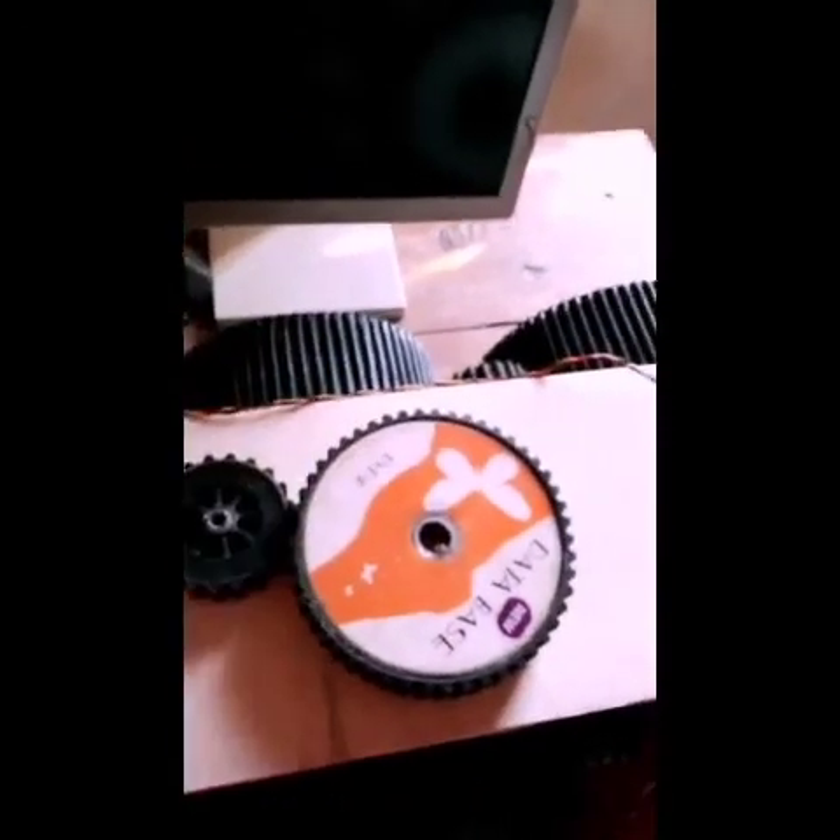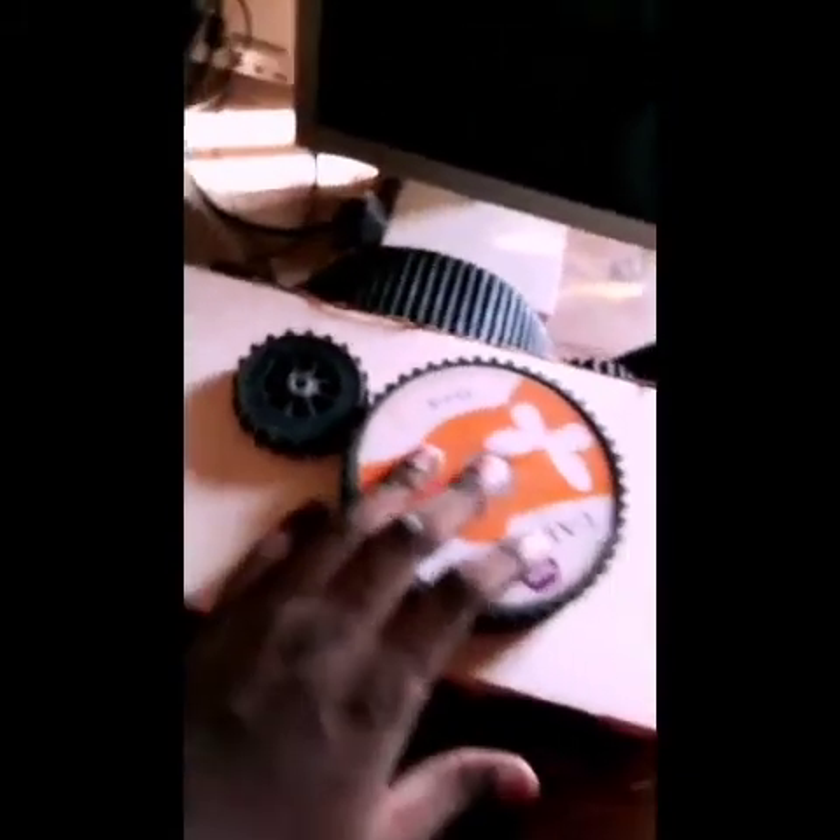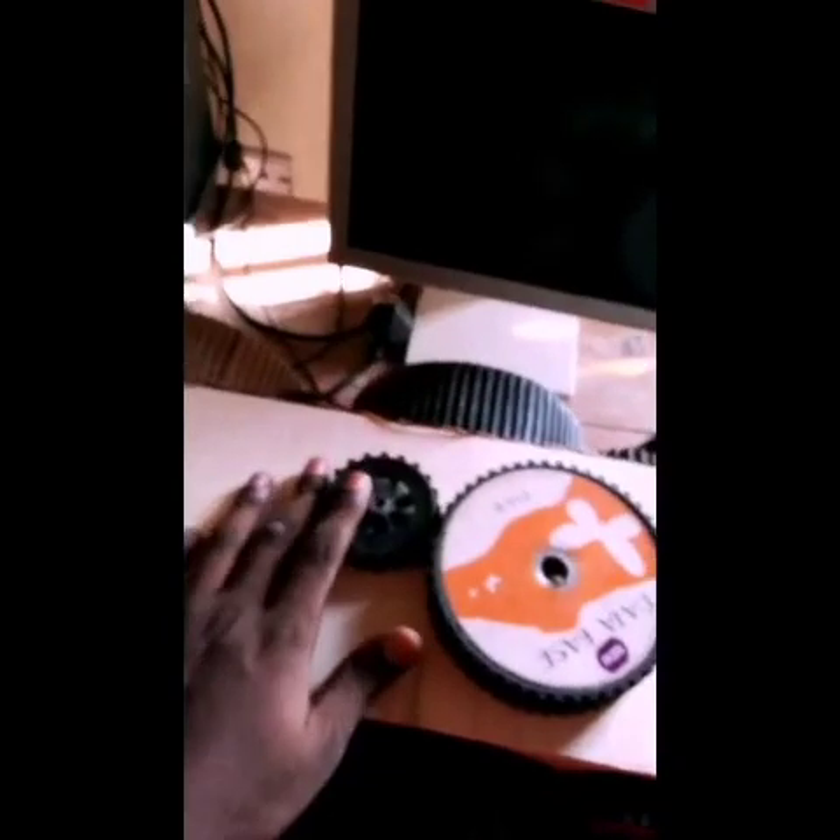I made three extra wheels and you can see some driver gears in between each two wheels. This is the basic idea and this is why I love this vehicle. If you understand the principle of gears, you'll agree that if a smaller driver gear is rotating a bigger driven gear, you get a lot of mechanical advantage, although the velocity ratio will be less. But it's going to give you a lot of torque — the bigger your driven gear and the smaller your driver gear, the more powerful your vehicle is.